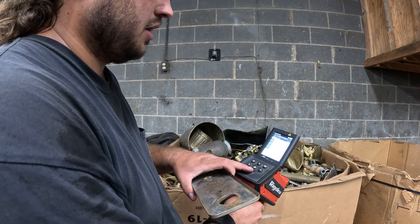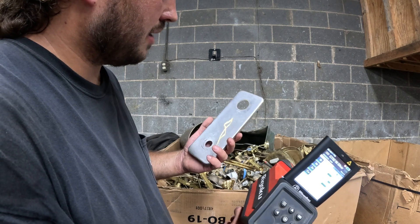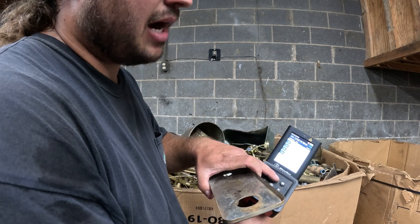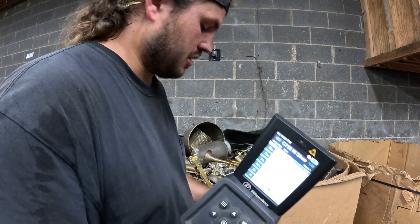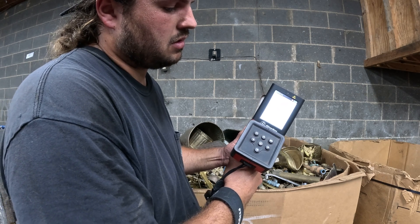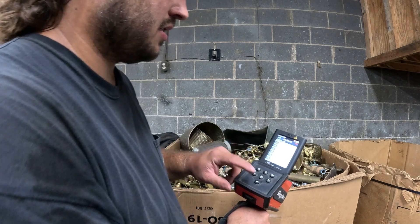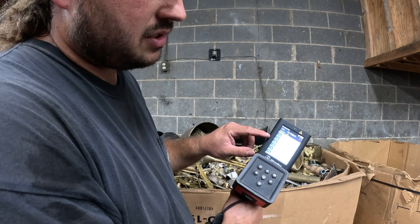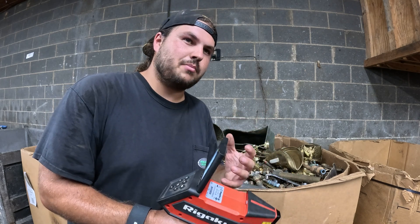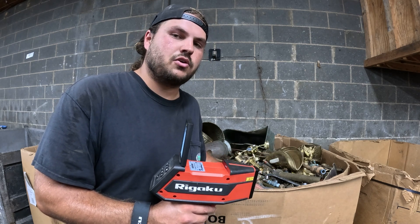This time we got nickel silver, showing 16% nickel, 18% zinc, and 64% copper. I got closer to the yellow spot but still picked up some nickel. I would have expected closer to 60% copper and 35–40% zinc. Let me try one more time on the inside section. This time we're getting even closer: 70% copper, 26% zinc, and 2% nickel. So on the same piece we went from high nickel and high chromium to high copper and high zinc — and that's why it's very important not to rely solely on this analyzer without making sure the surface is properly prepped.